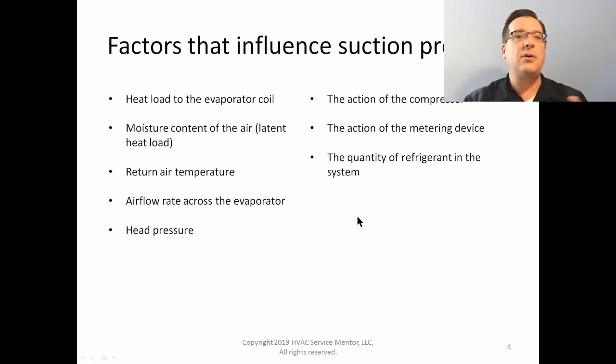Absolutely it is. And here's what's going on. Here's why that's so important. When we have an air conditioning coil freezing over, there is refrigerant in there able to absorb heat, and it does. And where does it absorb it from? It absorbs it back from the refrigerant, causing it to get even colder. And this is what can lead to the freezing coil. If we do not have enough refrigerant in there, we are not going to have nearly as strong of a refrigeration effect. And in fact, the temperature of the vapor leaving that coil is going to be nowhere near freezing. In fact, it's going to be higher and higher and higher.